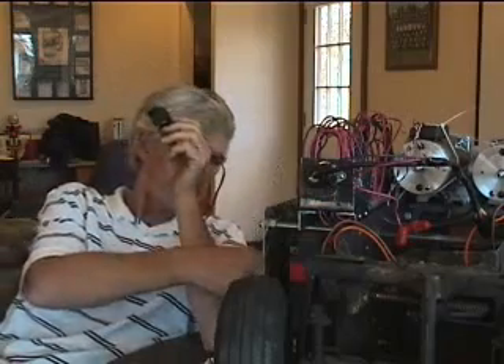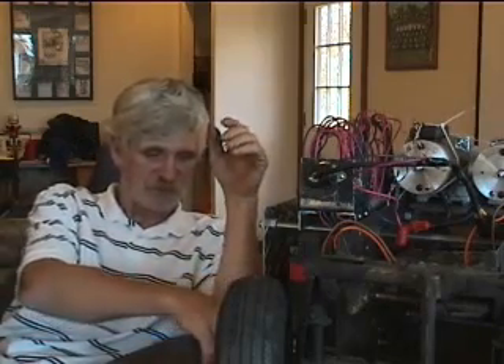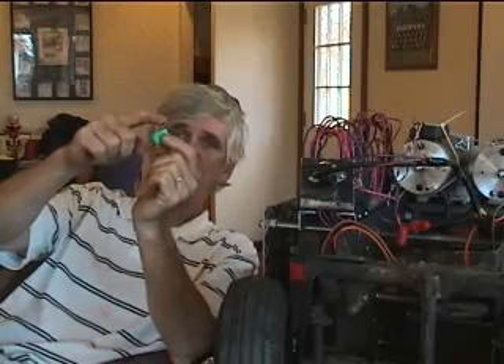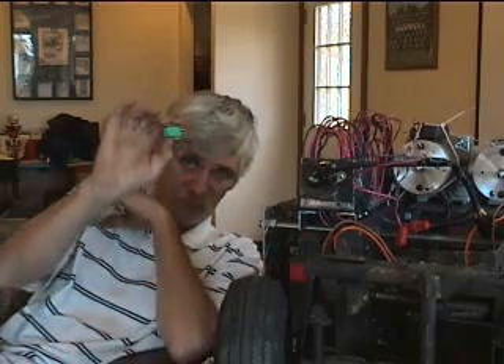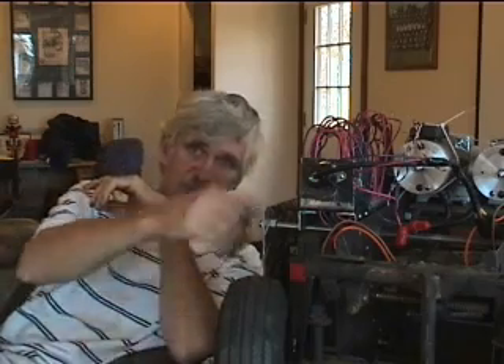When we move this lever on this control here, this moves this little motor — very easy. This is a micro switch. It's just a micro switch — it's on and off, very easy to operate. But you don't want to run too many amps through this thing. You don't want to run this motor directly off this micro switch, because as soon as you come under load, you're going to burn the micro switch out. Which probably wouldn't get you in an accident, but it would burn some wires and it's embarrassing — I've done that plenty of times. Remember the micro switch — it's key in this control system. On my website I have a total layout of what we did with this control circuit right here.